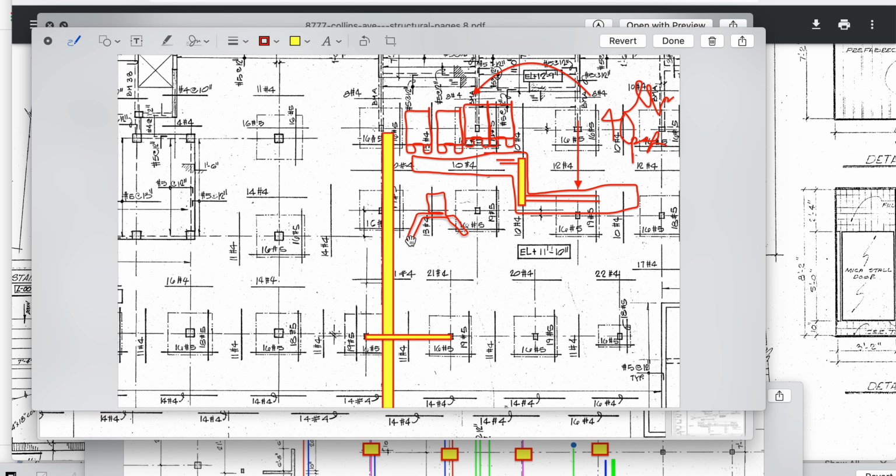Let's do a little exaggeration; allow me a little liberty on a gapping a little bit. So there's your tire loads that come down like that, right? They're the tire loads, they're like that, and they taper off, but in a 9-inch concrete, maybe they don't taper off at all. They just present themselves at the bottom of the concrete.